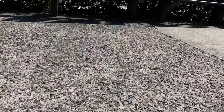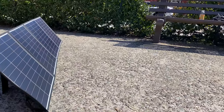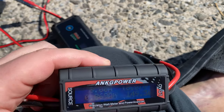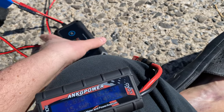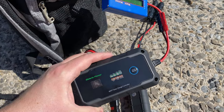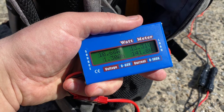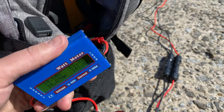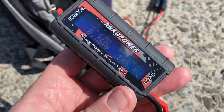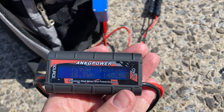So sitting here for a few minutes figuring this out — that's the sun up there with just a slight haze. Over here we're getting 149 watts into the MPPT charge controller, which converts it to a total of 10 amps at 13.4 volts. It says 10.65 amps at 13.31 volts. So this controller can still do more than the solar generator we were using before — probably at least 10 watts higher.